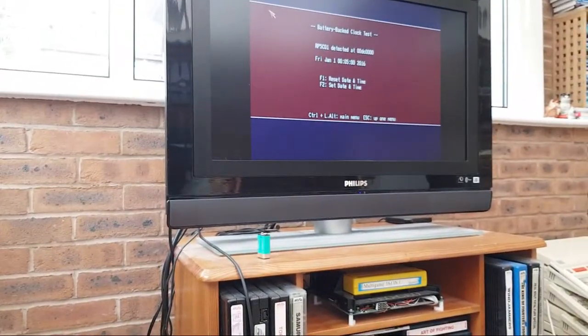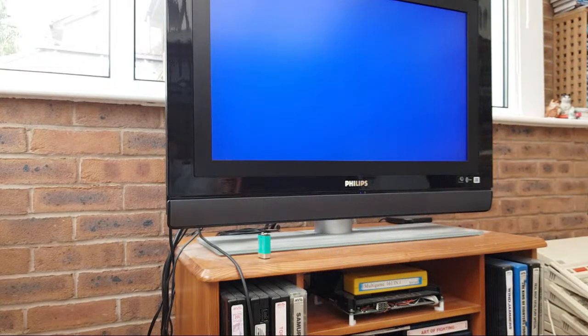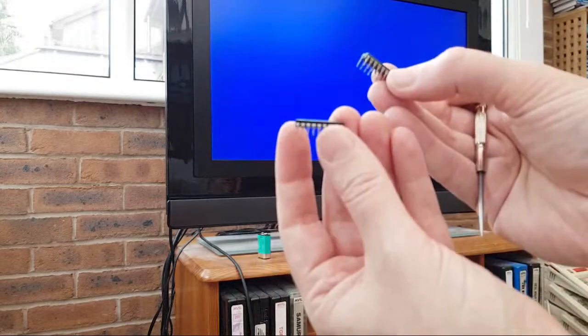But as I said at the start, I wasn't entirely sure whether it would fix it and whether we'd need to swap out the HC174 for HCT174. And the difference, I think, and again, correct me if I'm wrong in the comments, is that the HCT chip has TTL compatible outputs. But we've proven that's not the case. You can put HC174 on these in the clock circuit there if you need to. So I've got two ICs here I'm looking at in my hands, so I can perhaps show you them. These were the original ones off those boards. Let me show you what happens if I flip the first one here.